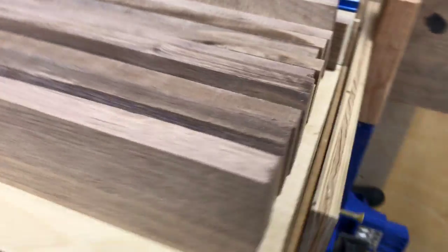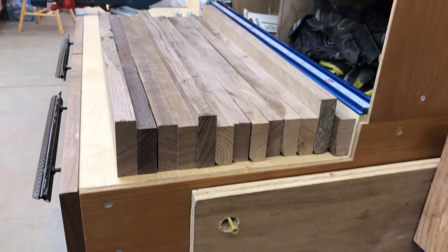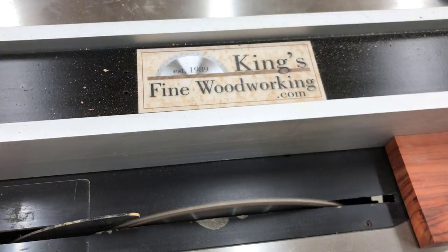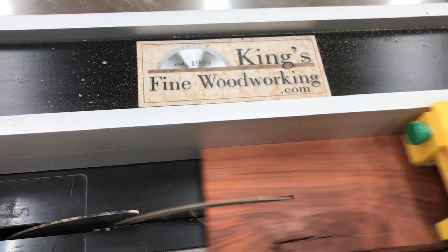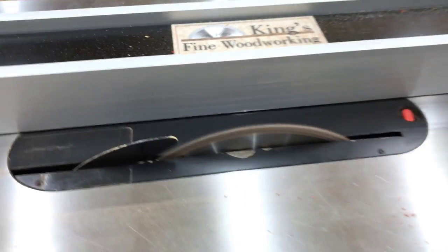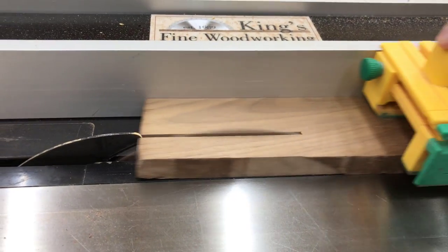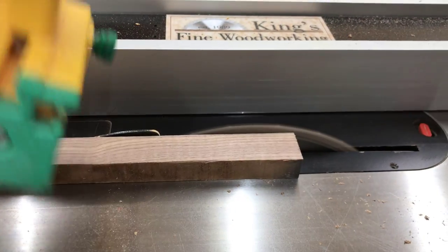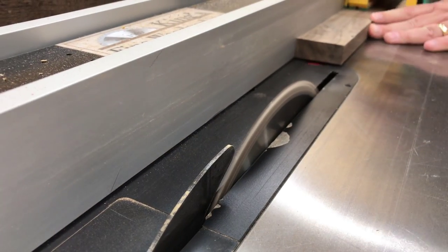Here's what I came up with today — a stack of walnut offcuts. I've probably got enough to make 10 more of these but we're just going to build one today. After cross-cutting everything to length — I think I cut everything to about 21 or 22 inches — I'm going to rip it down to a width that is basically as thin as my thinnest piece, which I think was about an inch and a half wide.